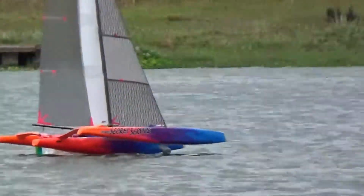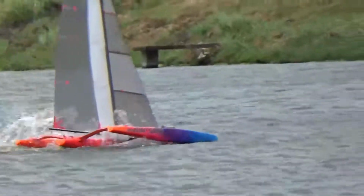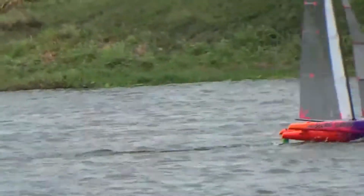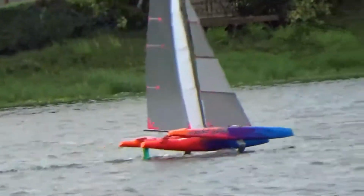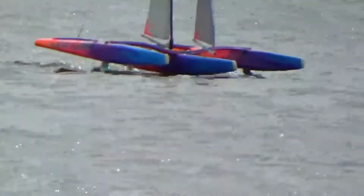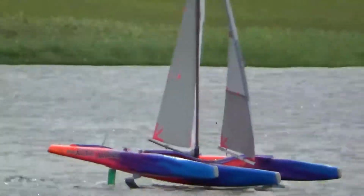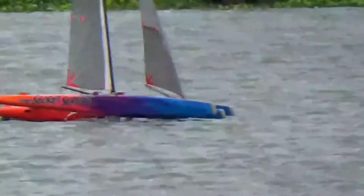The idea behind these foils is that the first section is flatter to get more lift in lighter airs. The second section is steeper, thus reducing a sudden reduction of foil area in the water as speed increases. The forward rake of this section is so that as the boat rises, the centre of lateral effort of the foil moves forward, improving directional stability at the higher speeds. The winglets are there to give improved positive reaction to the steering.